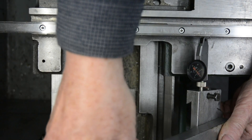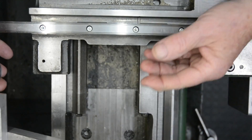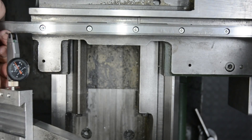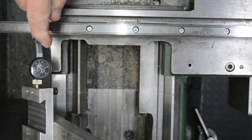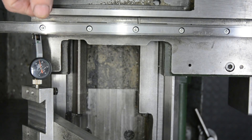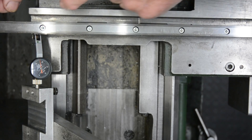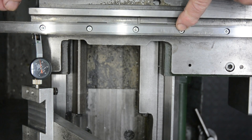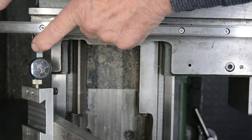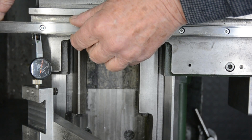I'll sweep the mounting point around about the axis of the lathe spindle. Bring it down here — we're reading about minus 11 and a half thou. I've got all of the mounting bolts except this one fairly loose at the moment, so it'll pivot about this one which was the closest point to when the indicator was over here. So I'll now push this in.